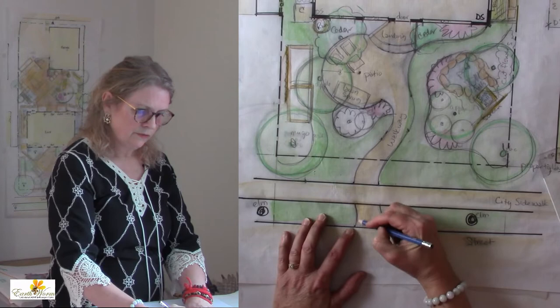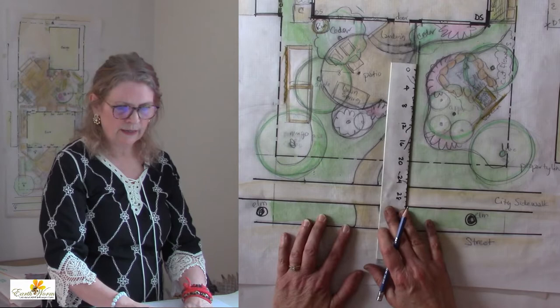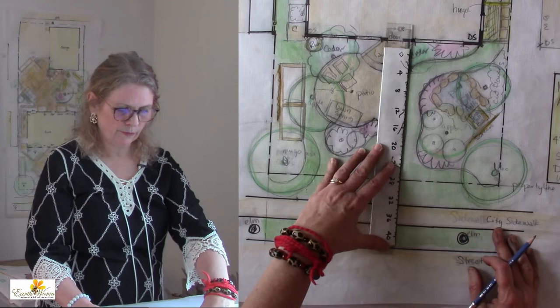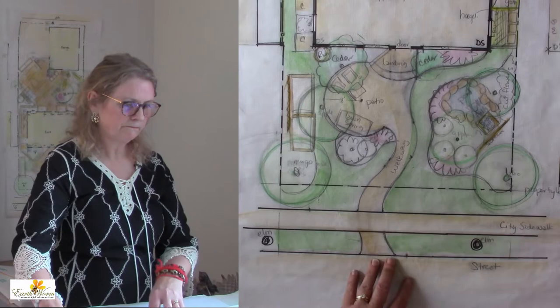That is how easy it is to lay out even something that's way out from the house. Always just find a nice straight line and be as perpendicular to the house as you can, or lined up with the wall of the house, which is often even better. It's easy to go a little off kilter when floating from a wall, but lined up with the wall and then measuring over from that spot, you know you're nice and perpendicular.